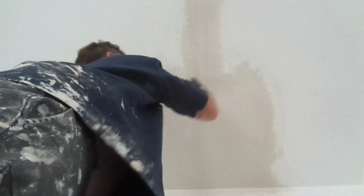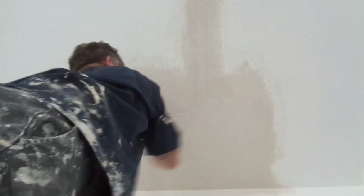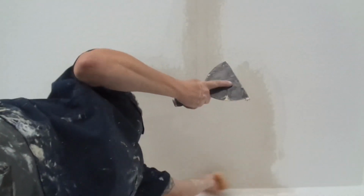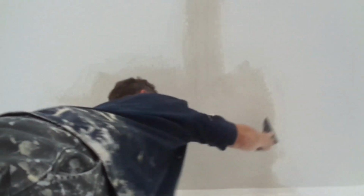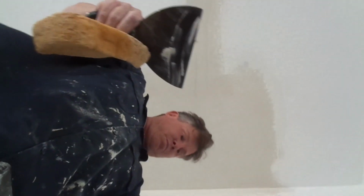Sometimes more mud isn't good. That's the problem. Most people put too much mud on. You don't want a big 2x2 hump on your ceiling because you think you just put a big glob of mud on. Anyone could glob mud on a patch. It's about putting the mud where it's needed. Kind of like I'm fixing a dent on a car. I don't just smear Bondo all over the fender. I put the Bondo inside the dent to fill in the dent. And I don't put the whole can of Bondo on there. I just put what's needed to fill in the area only. And if it needs more, then I'll do another tight coat. Extra mud taken off. It's pretty much set up now.